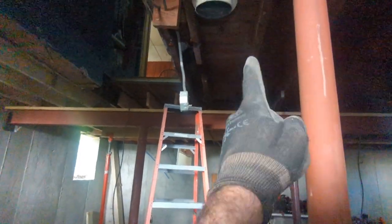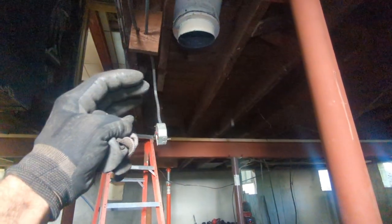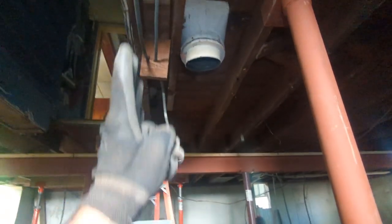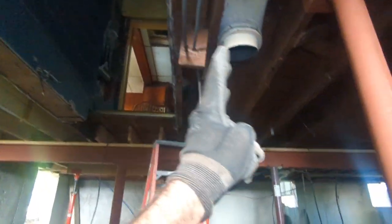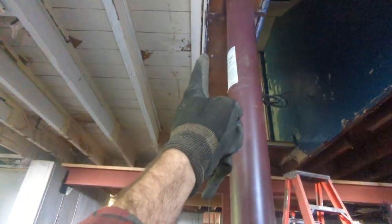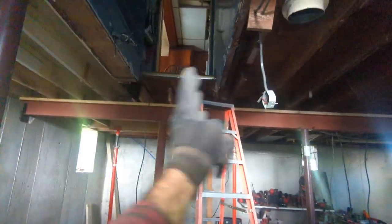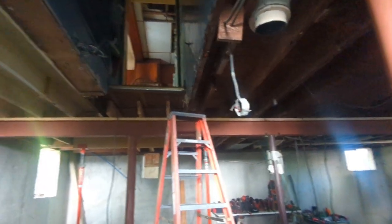But basically, this is the last joist. Then there's nothing. These floorboards are coming over and are loaded with the wall and everything going on upstairs and the traffic on the stairs that are loaded under this wall and everything else like that. And then there's nothing over here until you get to this joist. Because this is all boxed out, but I bet you it's all hollow. I think somewhere, yeah, I was looking in there from the end, it's all hollow. So there's like a 6 foot at least, if not closer to 7 foot swath on this side of the house. It's completely compromised because of some jackass's heater install.